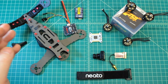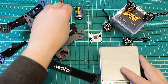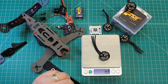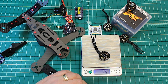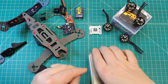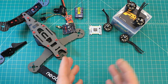We're kind of heavy on this build. Let's weigh these motors — the F-60 Pros come in at 36 grams, which is about six to eight grams heavier than a normal 2206 motor. So that's going to add some weight, but we're going to save it by using the 4-in-1 ESC. That's one reason to run them — another reason is it just cleans everything up.